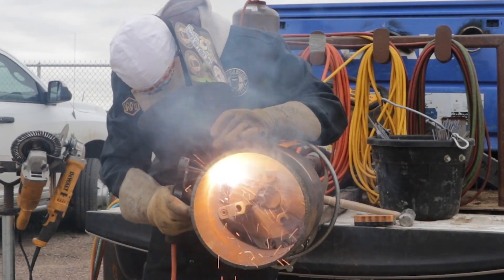You can see how wide that is — we're stepping now, starting to fingernail to the bevel closest to me. So I'm going to take my hand over towards the other piece of pipe, away from me. It's really wanting to stick to that piece closest to me, so I'm going to take my hand a little farther away. There we go — now we're angling in. There's a lot of high-low in this, so take your hand away from you and you want the top of that puddle burning off square.